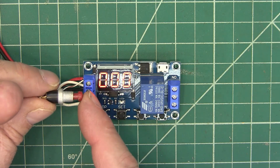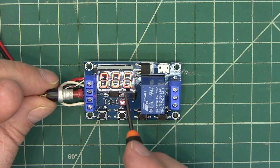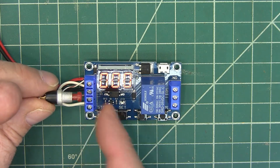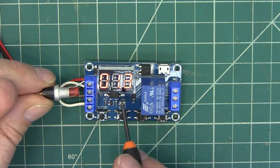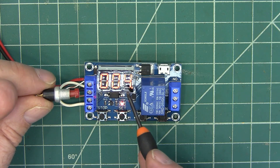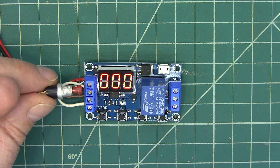When you start this one, we were actually doing tenths of a second — sorry. But what it does is when you start it, it goes to off first. So when you start it, it has a delay and then you'll see it come on. There it comes on, and it stays on for the amount of time you have it set, and then it goes off. That is P2.